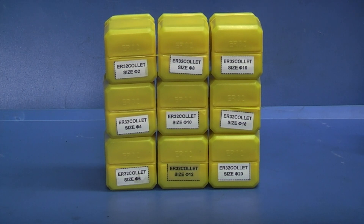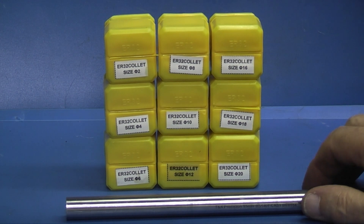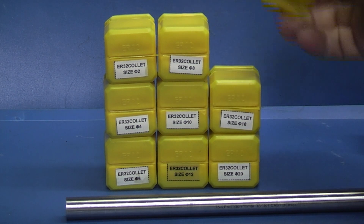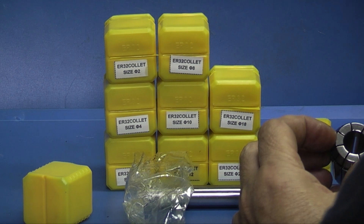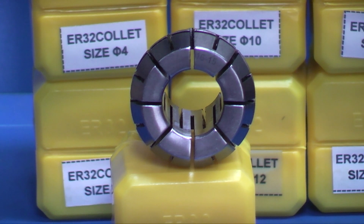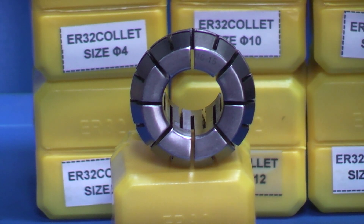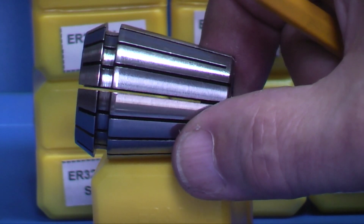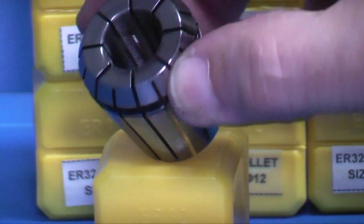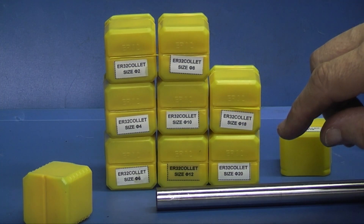What we'll do is take a collet and try it on the lathe — they should all be roughly the same. I have a bar of 15mm silver steel, so we'll take the 16mm collet, which should cover 15 to 16mm. I haven't opened them yet. You can see on the collet it is marked up — 16 to 15, 17. The finish looks good. I think sometimes these collets can be rough, but this is a very finely ground one, and even the bore looks okay. So we'll take that to the lathe, fit it into an ER32 collet holder, and see how true they run.